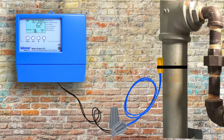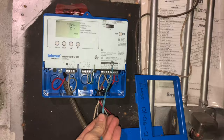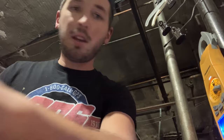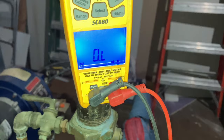Be forewarned — the condensate sensor might not be bad; it could be the thermostat wire. In that case, take the sensor off and plug it directly into your control. If the wire is bad, you'll know because the sensor will be sensing properly without any errors. But if it still comes up as not reading or showing an error, then it actually is a problem with the sensor. Take either end of the alligator clip, put it on the old sensor — open line — and that'll confirm it.